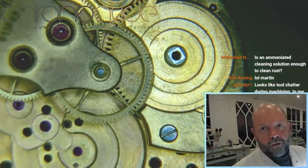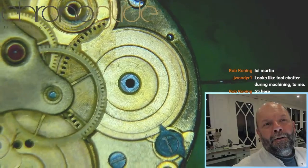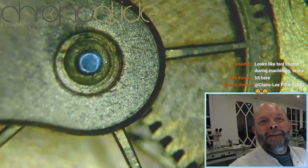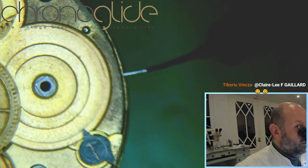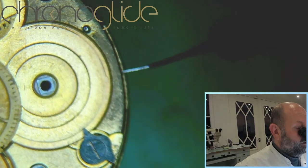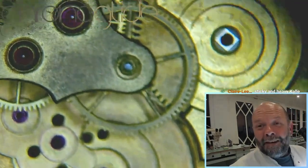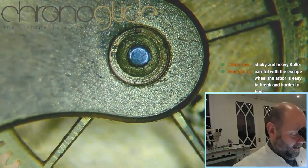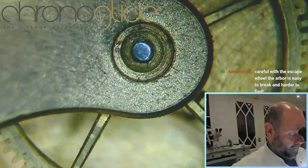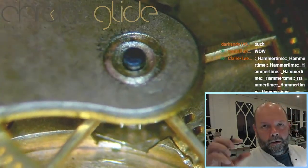I always do a small test. Here is the barrel — look at that center wheel. What I do is move the barrel back and forth between the teeth, not making any scratches. You'll see immediately if there is play in the gear train — just a nice end-to-end test. The interesting thing is the end shake.